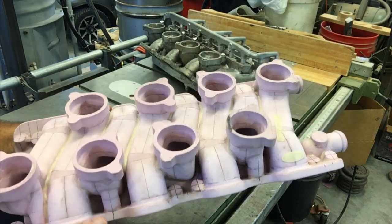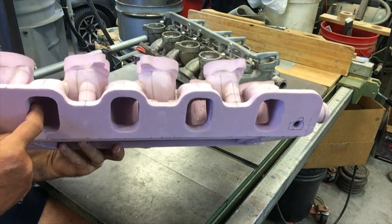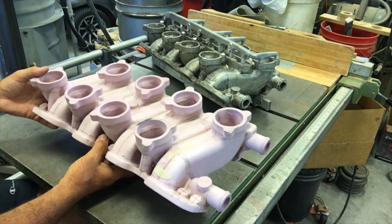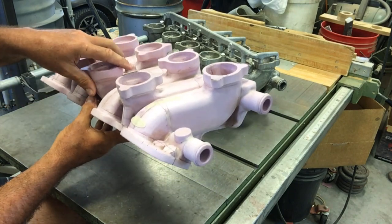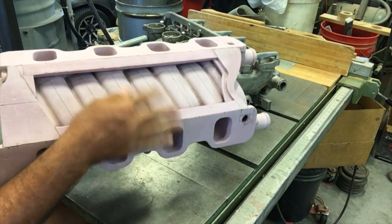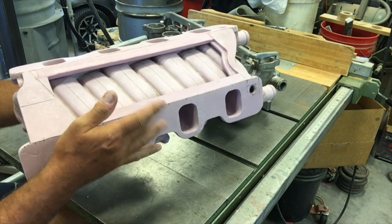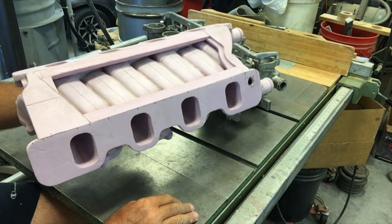Outside of that, it's on the same cylinder spacing as the 335 series Cleveland valve Ford engines, which is 4 3/8 inch. The whole thing is about 22 inches long by about 12 inches wide by about 4.5 inches deep. And I went ahead and put frame rails on the bottom so you could have a vacuum plenum down there. Most of the engines that you would run this on wouldn't be pulling much vacuum, and you wouldn't be thinking about vacuum, but there's some secondary utilization of the vacuum plenum that can be used for tuning.